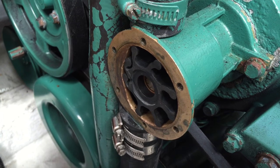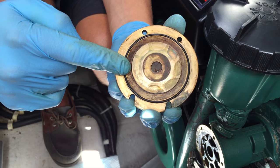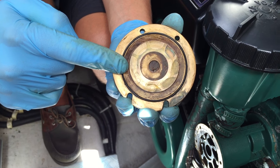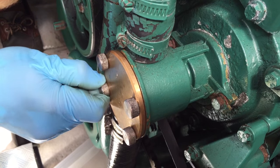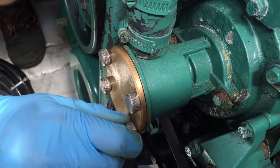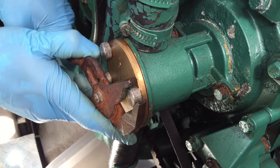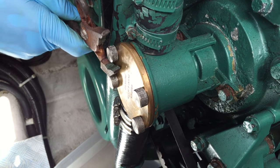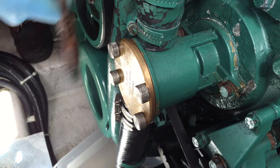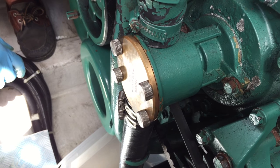We've put loads of lubricant all over the faceplate and especially over the little rubber ring — that's crucial because it's what seals the faceplate to the pump and stops any leaking. Kieran is tightening the thumb nuts, working crosswise first then going circular, to keep even pressure on the rubber ring. Remember: righty-tighty for doing up. That's secure. The really crucial final step: if you turned off any seacocks, you must turn them back on, otherwise your new impeller's life will be incredibly short. Seacock back on, and you're ready to fire up.